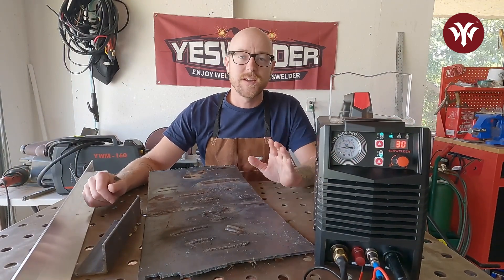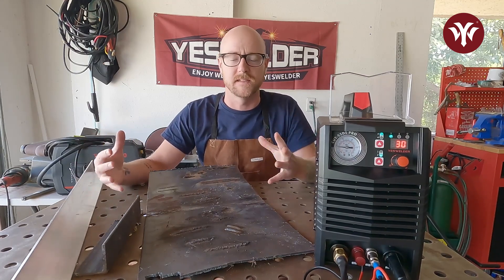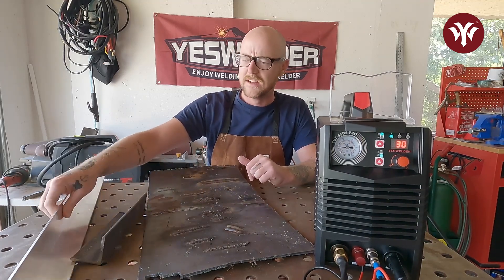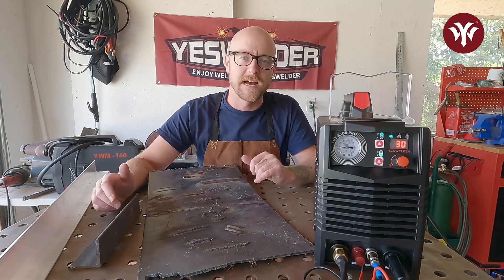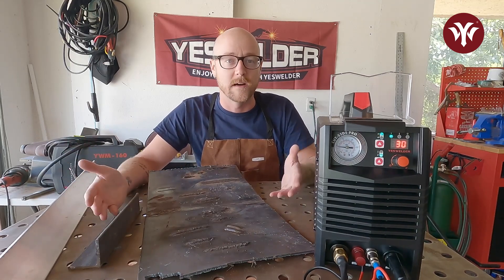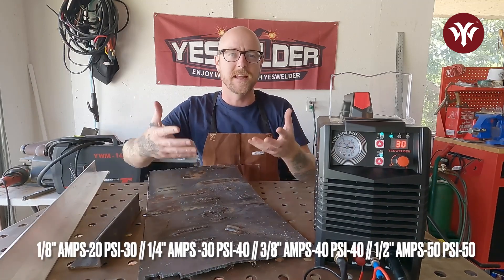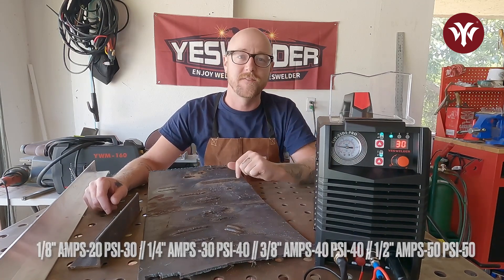So like I said earlier in the video, this machine will cut steel, stainless steel, aluminum, copper, brass — a bunch of different types and also different thicknesses. What we have here is some cheap metal, regular carbon steel — dirty, rusty, mill scale — a little bit of cleaner angle iron, and then some real nice clean aluminum, and we're going to be cutting through all of these with the Cut 55 DS Pro. One of the trickier things with plasma cutting is knowing where to set your amps and your PSI, because too much PSI can actually make for a bad cut as well. Down below is a nice guide that I like to run by, and it's also going to depend on how fast you're actually pulling the torch. These numbers are a great starting point, so I'm going to dial some of these in on the Cut 55 DS Pro.